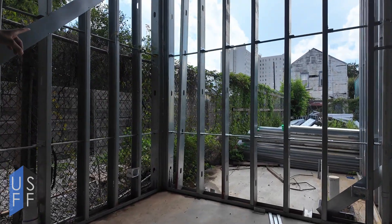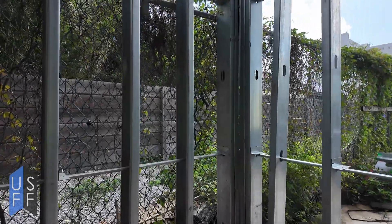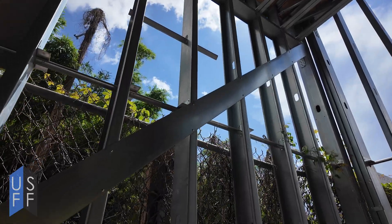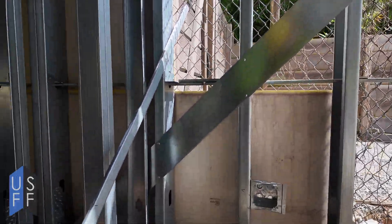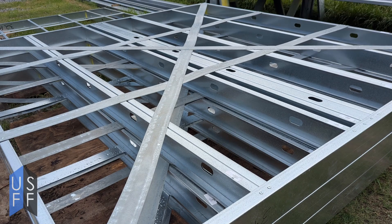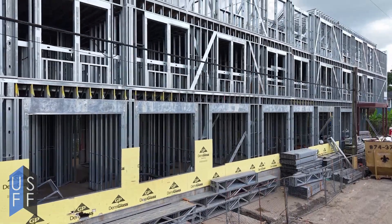Hold downs work very commonly in conjunction with shear walls. Shear walls, as they're named, prevent the building from shear forces pushing it over, because if you think about it, studs are like parallelograms when they're installed and they can skew if they're not braced properly. Typically shear walls have some shear holding force, whether it's plywood or x-bracing, that ties the wall and prevents it from skewing. Shear walls not only support themselves but they actually support the entire building and are placed in strategic locations to prevent the building from skewing over.